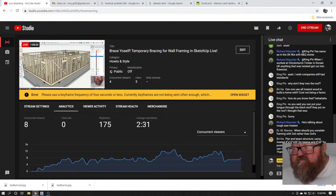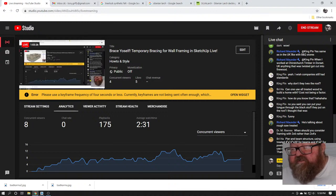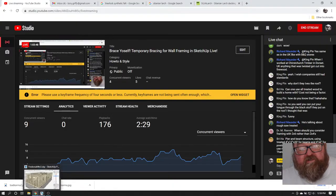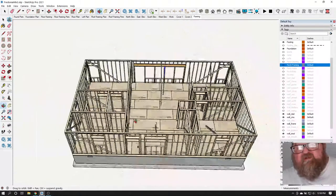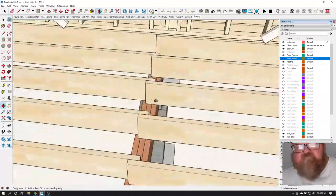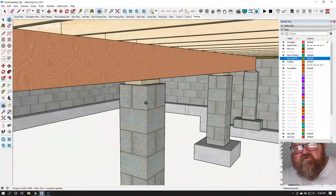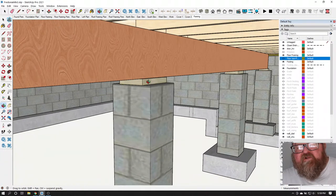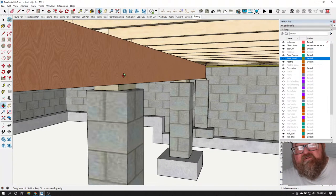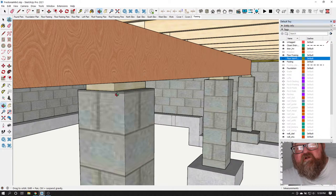A viewer describes a pier-beam structure using treated four-by-twelve-by-twenty beams, four-by-six posts, and treated ply for floor, then regular wood going up from there. On this house we have twelve-inch concrete block piers, a pressure-treated plate there, and then three LVLs for our beam — but it's not treated. The only thing that's treated is what comes into contact with your concrete.